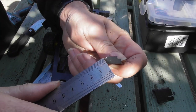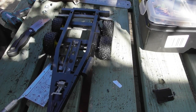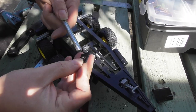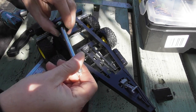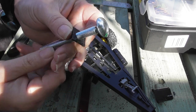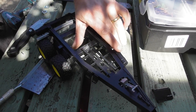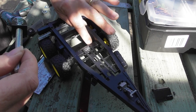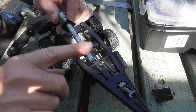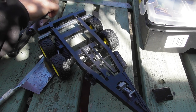And if you can see here, I put a couple of little notches in it, and the bit in the middle is about 11 millimeters, and that is going to sit just in here. The place it's going to go is, first of all, it's kind of almost forming a washer up against this square bit of the bolt there, and the bolt will be going flush against this crossbeam on the chassis, and the end of it just about goes into there. If this bolt was any shorter, I'd have to use a longer bolt, and I may still end up having to do that.